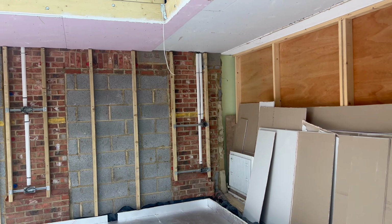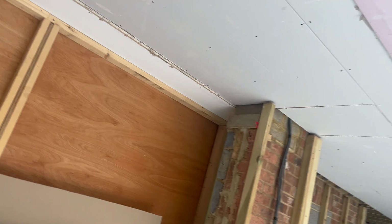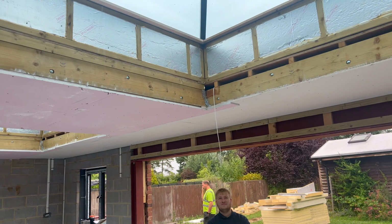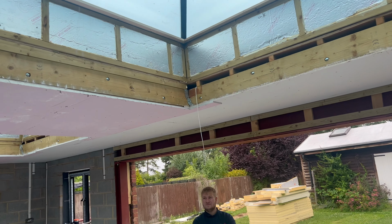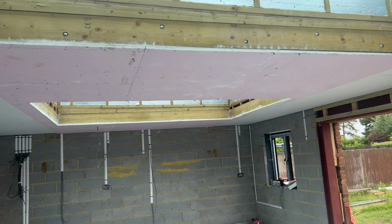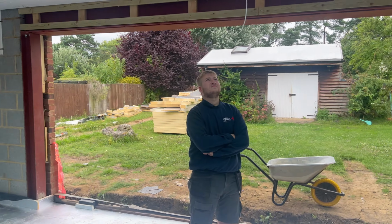They're having these lanterns in here as well, with LED strips, but with anything over 11 metres they've got to feed it at either end, so you get no dull bits through the volt drop and all that. But yeah, this is a slight bit different to where we've been all week, Ollie, isn't it? Yeah. Right, let's get into the rewire.